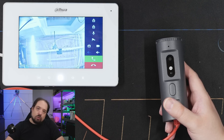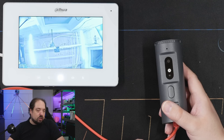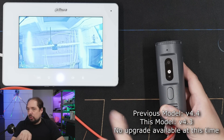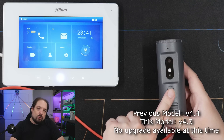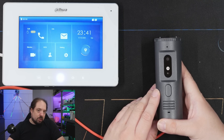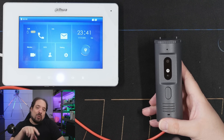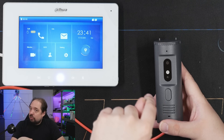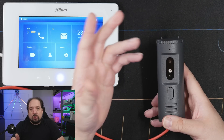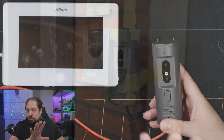The video response is pretty responsive. In regards to software, I believe these units are mostly identical, but I have noticed a difference — it's not the same firmware binary. This one is running an older version than the previous model we looked at; that one has a newer firmware available. Some options were also missing: with the other model I could select 1080p or NTSC, for instance, but this one is locked to PAL — so 25 frames per second — and we can only do 720p, although this is supposedly also a 2-megapixel sensor.